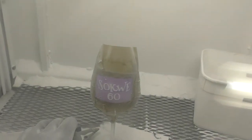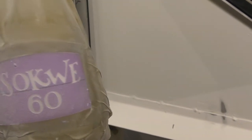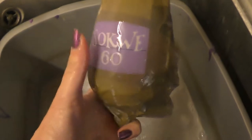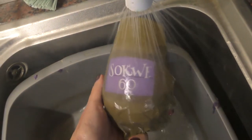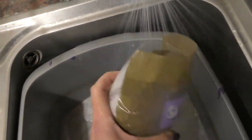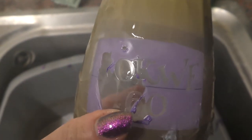I have now measured, stuck tape on the background and sandblasted. I needed three hands in order to film this, so you missed that little bit. And I've sandblasted relatively deeply, not too deeply, because this is not a thick glass, but you can see the edges. You can actually put your nail into it. And now I will be washing the tapes off. Again, I need three hands to show you, but anyway, you get the idea. Need to be an octopus for this job.